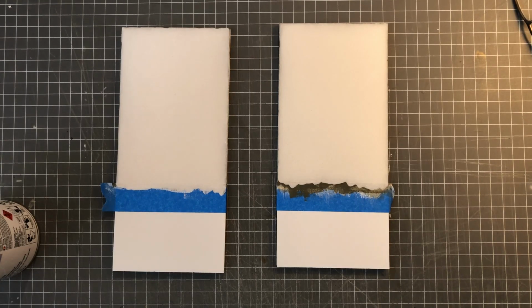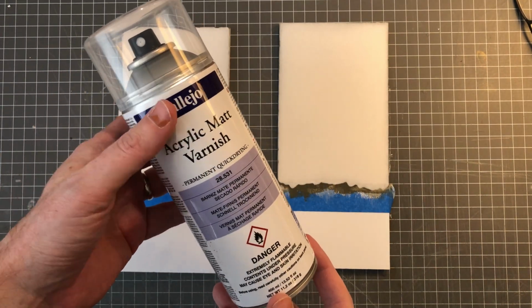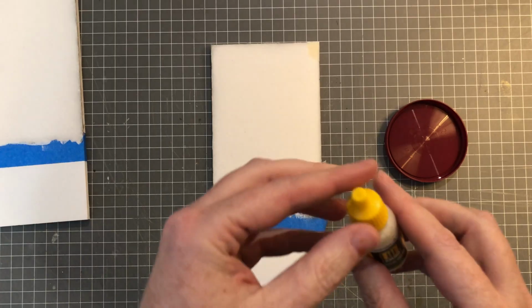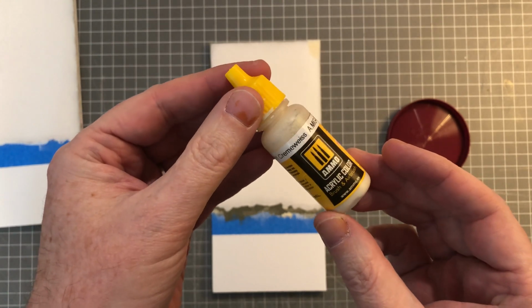The plaster in its original state is very absorbent, so before applying the final coat of paint, I'm priming each panel with matte varnish, which I've got to do off camera. The colour I've chosen for the final coat is a cream coloured acrylic, and this was applied to the 3 lobby walls.